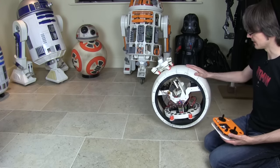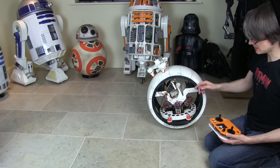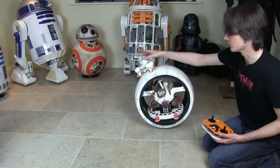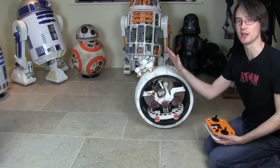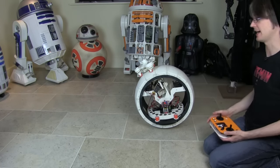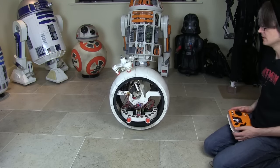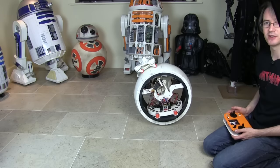Things are going to change slightly as we get more mass on the top, and I'm interested to see how that works out. I really need to get this head actuator arm in. At the moment if I push the head it rocks forward, because it's fixed to the hub which is trying to stabilise so the outside of the ball stays still. Once the head actuator is in to push the head backwards and forwards, we can apply some extra stability: the IMU on the head stick can be used to keep that angle constant. If it stops suddenly and the head falls forward, I can compensate by pulling that actuator back to keep the head at a constant angle. I'll also be able to put it right back in the middle for turning on the spot.